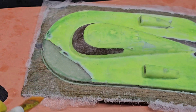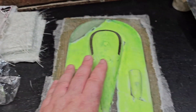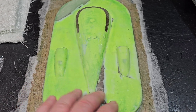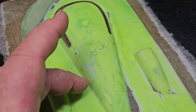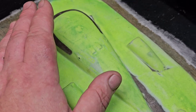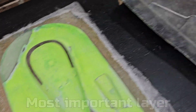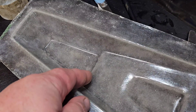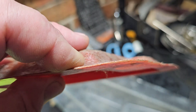It's all tacky, so I'm going to let it cure out to about 80%. It's still tacky but I can touch it and put my next layer down without having to sand. I waited until now because if I'd done it while it was wet I might have introduced air bubbles. Remember, this is the very first layer — the top layer of your mold. As long as you get this one down with no air bubbles or imperfections, the inside of your mold should be pretty good. Now we're just building up thickness so it doesn't deform, crack, or break when you pull it off.